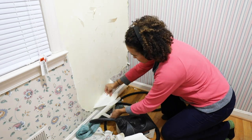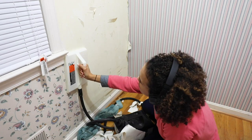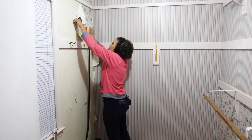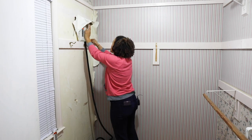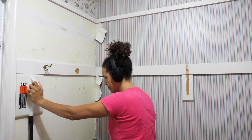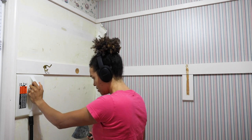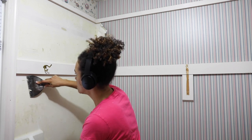We can speed this up a little bit. Notice my towel is already wet, so make sure you have a lot of dry towels. You'll also see me removing the air vent in the bottom left corner — you want to get that wallpaper underneath. Wallpaper removal is really messy, so make sure you've got some trash bags nearby. Once you remove the wallpaper, the next step is that you actually have to remove the glue from the wall. You've got to apply steam to the wall again just to loosen up all the gunk that was holding the wallpaper to the wall.